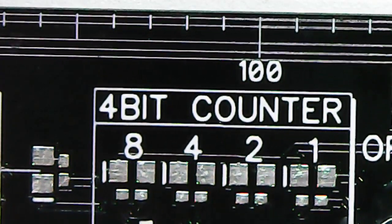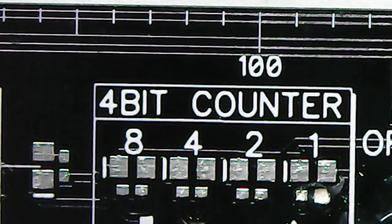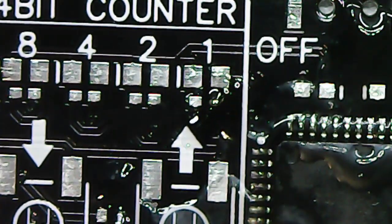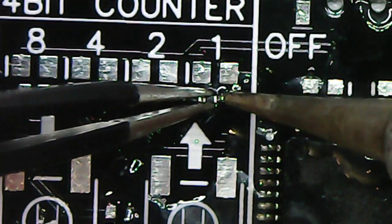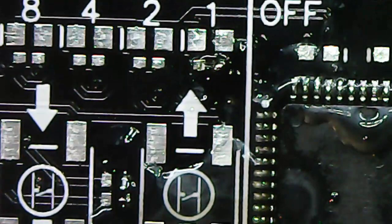That's all the component types shown here. We covered: the microcontroller, 10K resistor, 1K resistor, LED — making sure the green dots face the white line on the board — the button, the switch, the capacitor, and finally the battery holder. For the rest of the board, just copy and paste the button with its 10K resistor and the LED with its 1K resistor all the way through. The DigiRule 2 is very similar: same component types, microcontroller with capacitors either side, power-on switch, buttons with 10K resistors (except those eight special buttons which use internal pull-ups), LEDs with 1K resistors, and a battery.